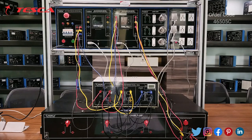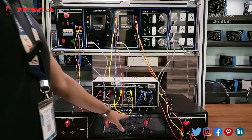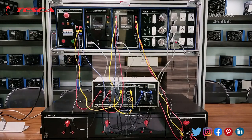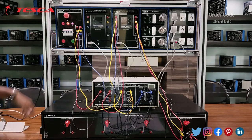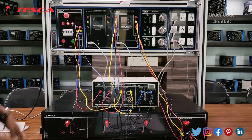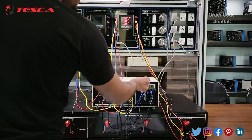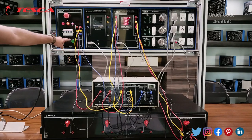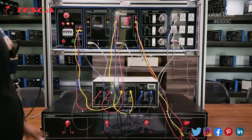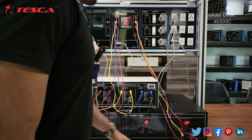After the connection is done, we keep the three-phase selector switch at the fifth position — the maximum — before switching on the trainer kit. We provide the three-phase input power using the four-pole MCB. The dual LEDs indicate we are getting supply. We switch on the multifunction meter, switch on the three-phase transformer LCD temperature meter, start the fan of the load panel, and press start. The line-to-neutral voltage shown is 71 V as we are using the maximum load.